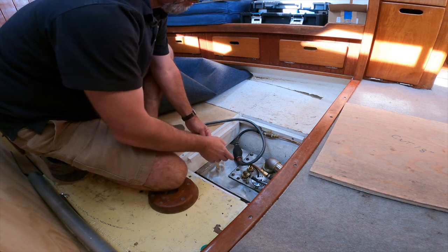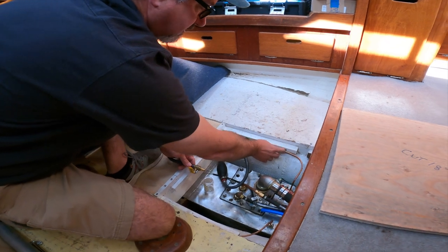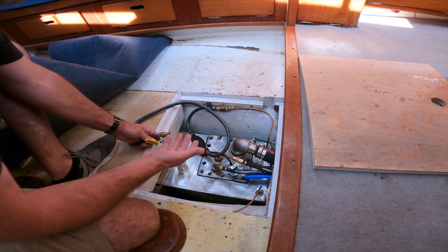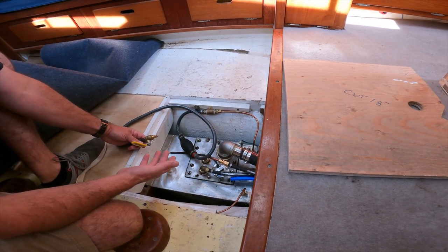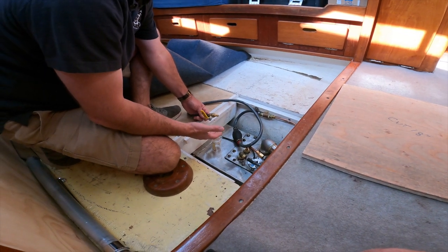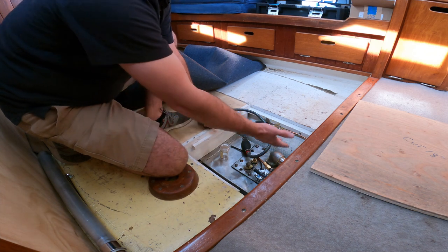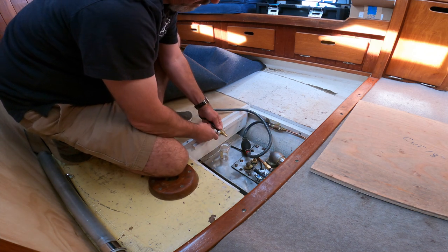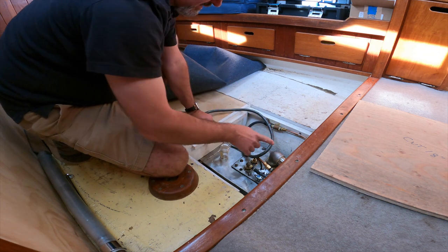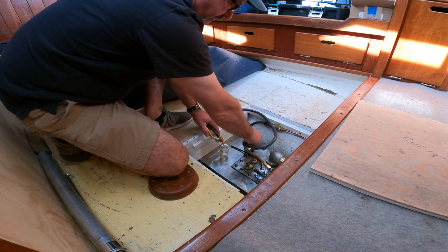The new owner Greg is going to appreciate this fuel system. We've got our stripping port with a couple of adapters and P-clamps, tied it down. We have an outboard motor fuel primer bulb — which is not technically rated for diesel, but diesel is less offensive than gasoline — and this whole system, with the shutoff, lives outside of the fuel area. It will take a little bit the first time to get it primed, but this goes to the very bottom of the tank.